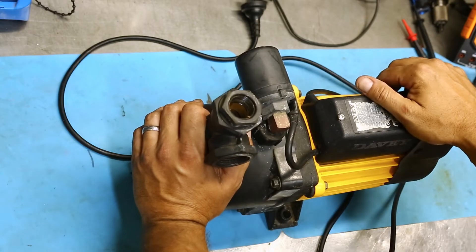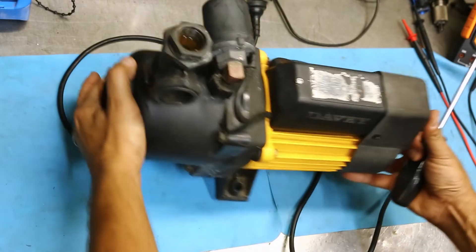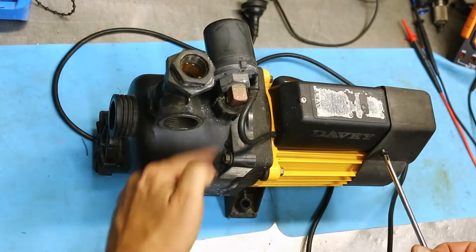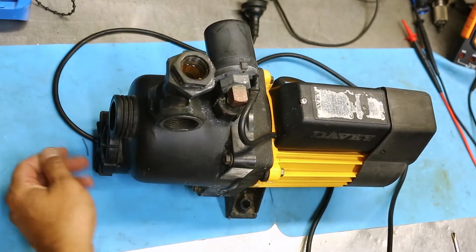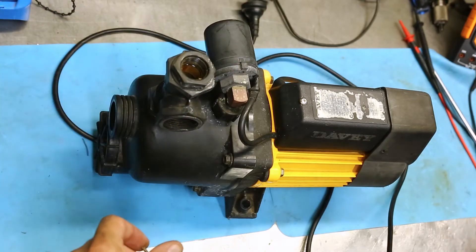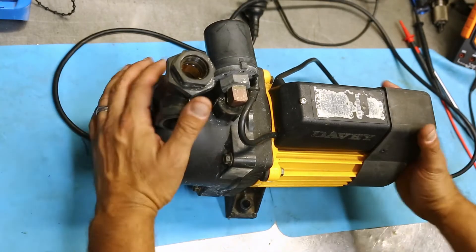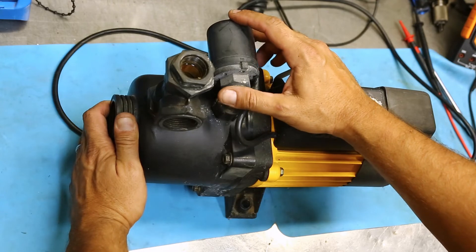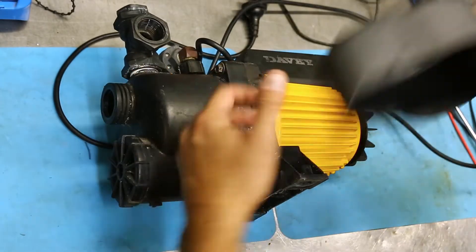He told me it was working fine but just unreliable, so it should be a pretty good pump overall. There's very little to these pumps — you have an induction motor, an impeller, a stator inside the housing, a one-way check valve on the inlet at the front, and the outlet here. There's a pressure vessel on top — I think it's the 8-litre one that came with this — and all of that was in great nick. Parts are readily available and not too expensive; I replaced the pressure switch on ours for under 50 bucks.